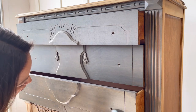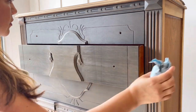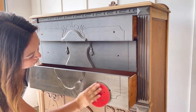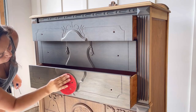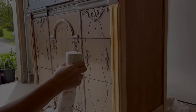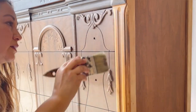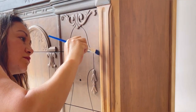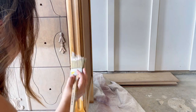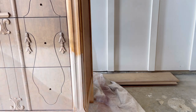After applying old-fashioned stain over the pink color wash, I noticed the bottom drawer looked too light. So after spraying it with water I took an extra fine sanding sheet and sanded some of it back. I debated what to do with the sides of the dresser — whether I should just apply the ash color wash over them — but after thinking about it I decided that I wanted to see that color blending or ombre effect on the sides still. I just made sure that when there was that color transition on the front, it followed to both of the sides.